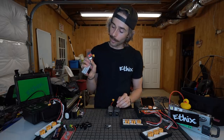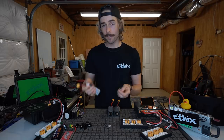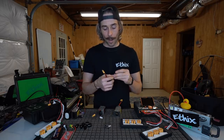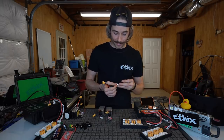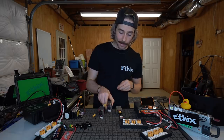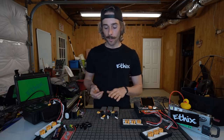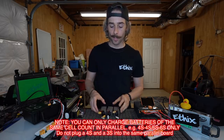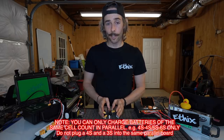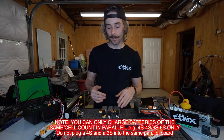So what I'm doing, I'm plugging it in, I'm waiting for it to go, and I'm gonna see that it's at 23.1 volts. This is a 6S battery, so 23.1 volts. This one, and why I have multiple is because it takes a second to see that, so I can plug multiple in. This one's at 22.9, and this one's at 23.1. Okay, so they're right around 23 volts as far as the entire battery is concerned. Now, I do know that all of these batteries are in good shape, as far as maybe one cell might be dead if you have some battery that's really old.